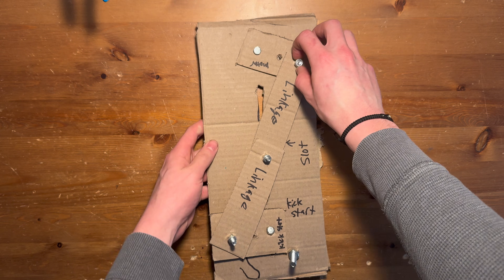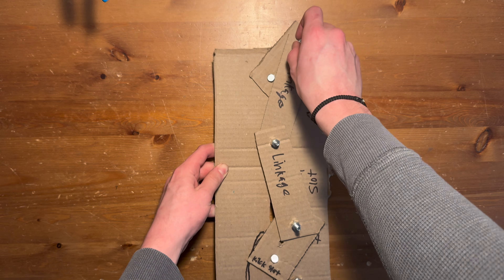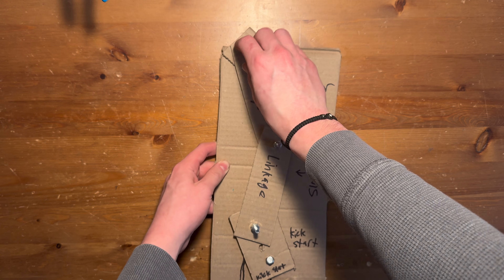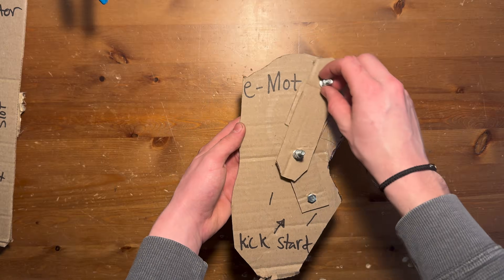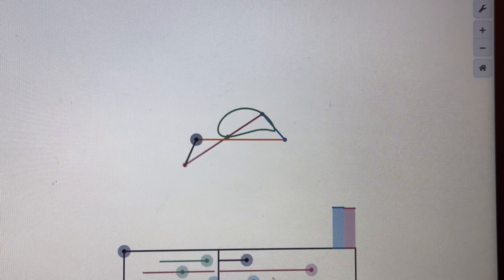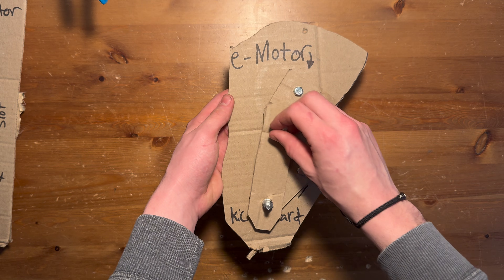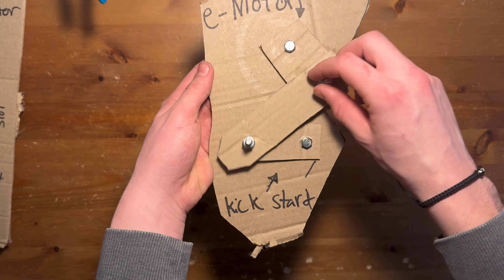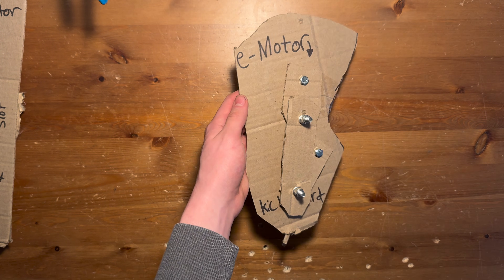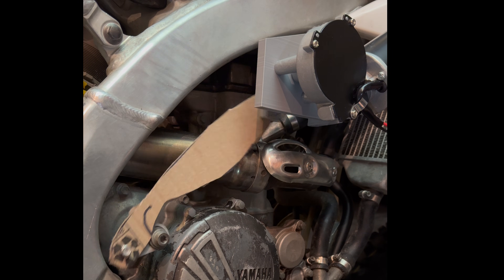The first thing I did was create a little cardboard model. The first mechanism I decided on was inspired by a four-bar linkage, except it was messy and had a slider in the middle. I was able to refine it into something simpler — a more normal four-bar linkage design. The key reason I used this is that electric motors are more efficient when continuously spinning, but the kickstart only allows about 150 degrees of travel, so the linkage converts rotating force into a reciprocating force.